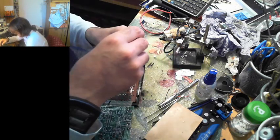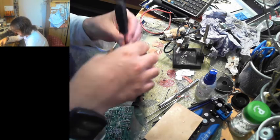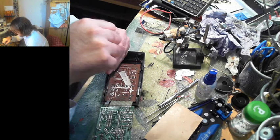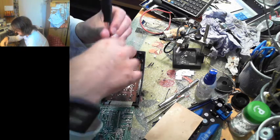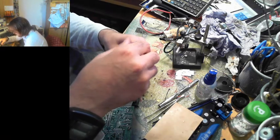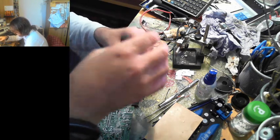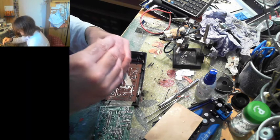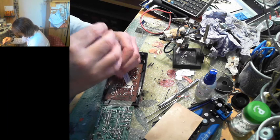All it needed was a little motor inside, because the shutter motors on them, it's a known problem, the shutter motor wears out. The only thing is you've got to take apart the whole camera to get to it. The lens assembly, the sensor assembly, the whole thing. The only assembly you don't have to take apart is the part that the lenses are attached to.